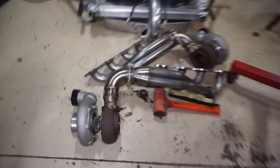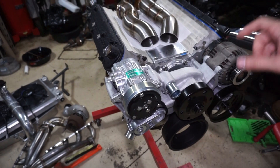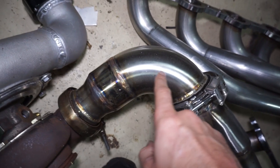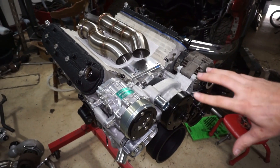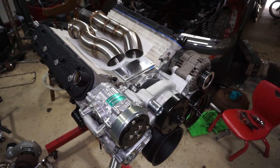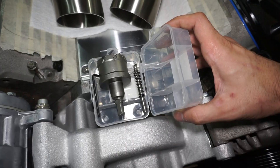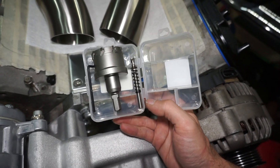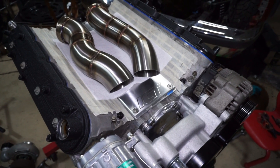This stuff is ready to start going back in. I've got all the rest of the turbo jam, then I can start finalizing the rest of the pipes and the mufflers. I did get a special hole saw bit for putting the wastegates on — I'm probably going to do the wastegate on the bottom side of these 90s. Once I get the converter, I can start bolting everything back up. I got a Circle D converter on the way, and this nice carbide bit hole saw I bought just to do the wastegates in the stainless. Hopefully I don't fight with that, because drilling stainless can be kind of an animal. Thanks for watching — hopefully you guys enjoyed the video, see you next time.